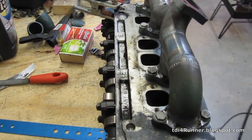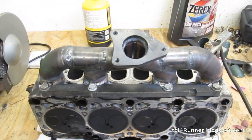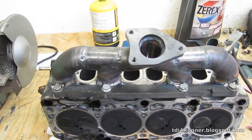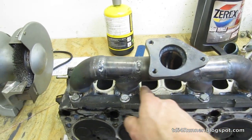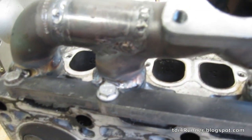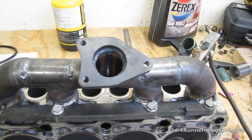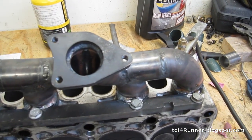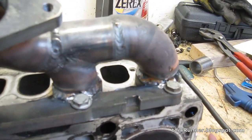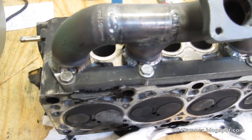This is a cylinder head that came with the engine I bought — the head's bad, it's got a bad lifter bore. It's nice though because I can use it to hold the header or the manifold so hopefully it won't warp as bad when I weld it. Got it all bolted down. Just finished welding the last parts around the primaries up next to the header flange. Had a little trouble getting the heat right on the TIG with this really thick flange — it's a half-inch thick flange on the head and then the Schedule 40 pipe, so a bit of a thickness differential, and I don't have a water-cooled torch on my TIG. But it should definitely hold and I know it's sealed up, so with the brace we'll be all set.